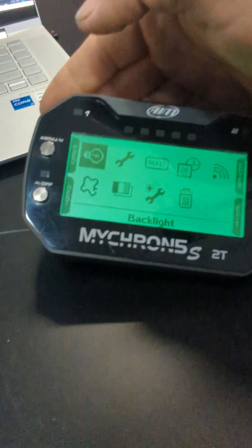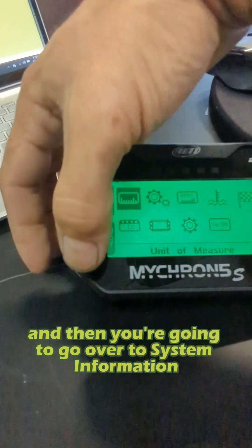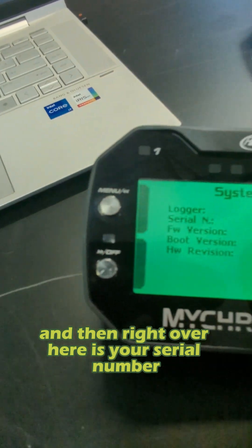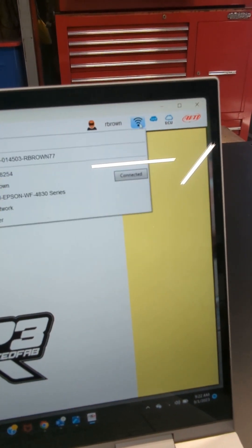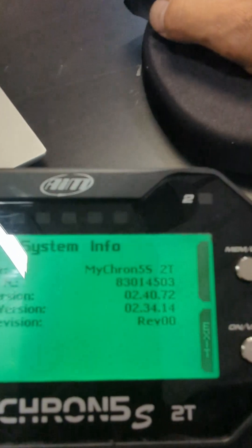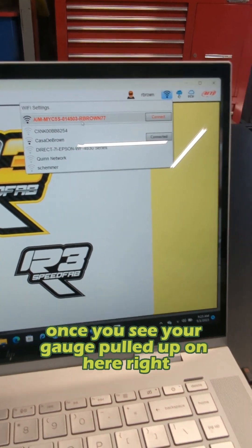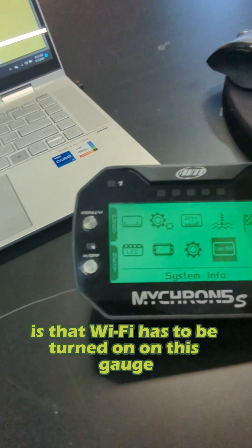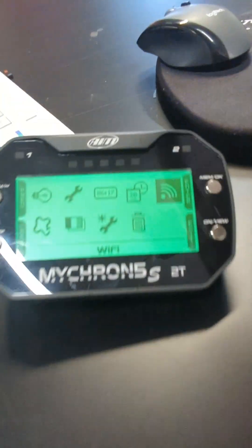If you don't have this connected, you're going to have to manually select the connection. How you do that is you're going to go into your gauge, go to Menu, go to Settings — the little wrench. And then you're going to go over to System Information. Right over here is your serial number. When you pull this up the first time, how this is going to look is just like this: 1-4-5-0-3. Those are going to have to match up. Once you see your gauge pulled up, now you can look to make the connection. Another important point is that Wi-Fi has to be turned on on this gauge, so we're going to go over to Wi-Fi and turn it on.